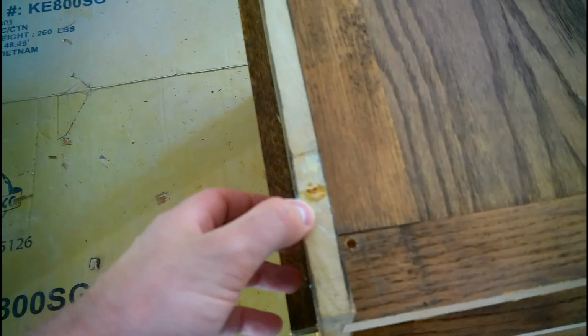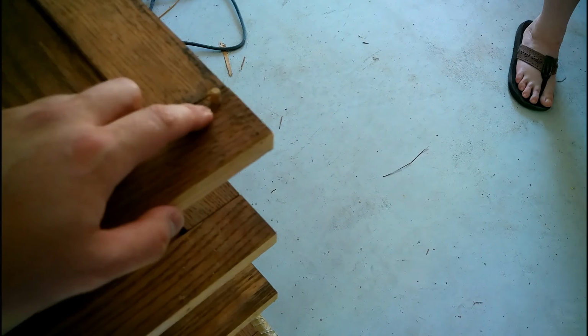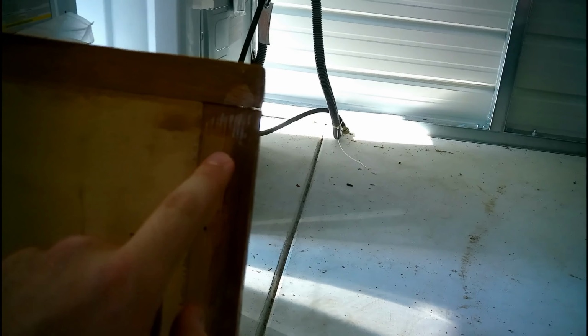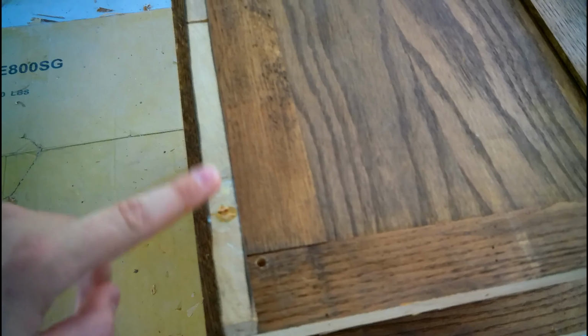if we look over here in these original pieces of wood, you'll see these little wood pieces. Broken dowels. They look like that. So what would happen is you'd have a dowel, and it would stick up kind of like this. And what you would do is you drill another hole on a separate piece of wood, and it would kind of look like that. And then you would put this perfectly, and I mean perfectly, because if it's not perfect, it's not going to work. You're going to break the dowel. You'd fill this with glue, and put the dowel in there after this glue is already set and the dowel is sticking out.